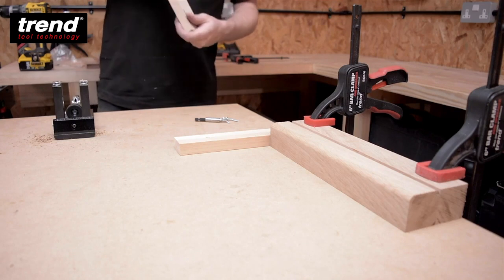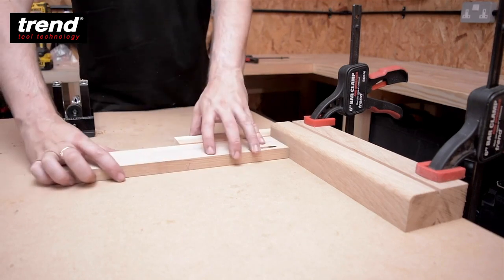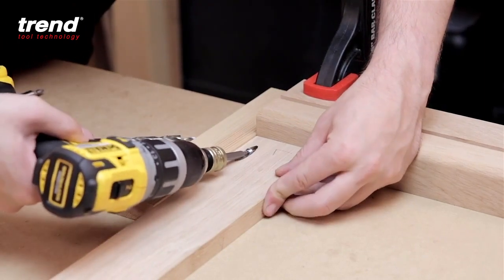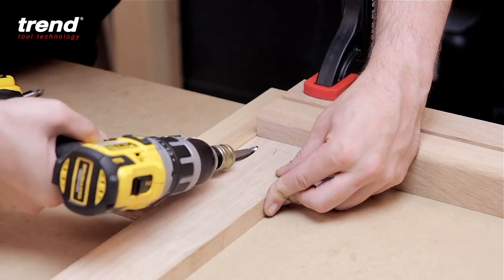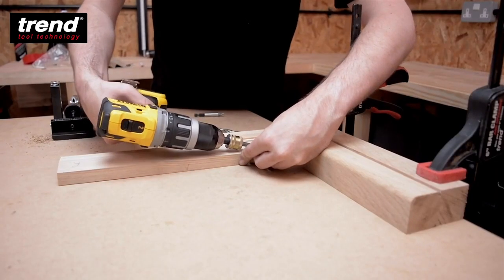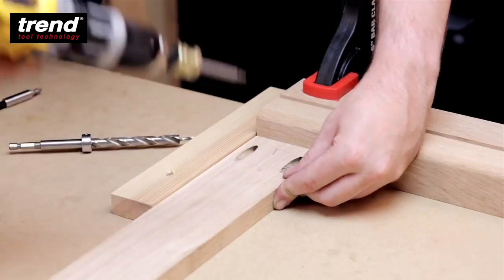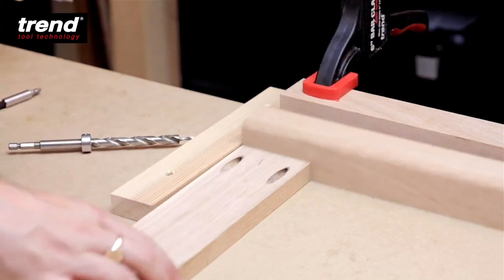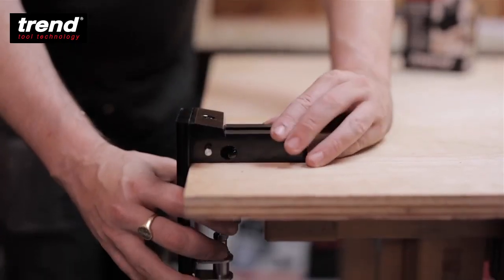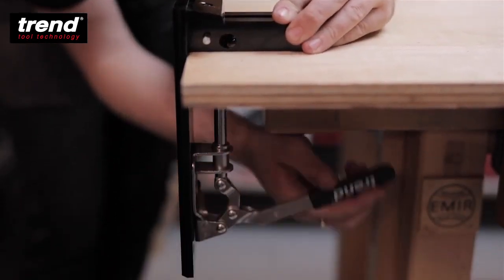When joining a 90-degree angle, position the material against a batten for support. The square drive self-tapping screws will join the material securely. A torque-controlled screw-driving drill is recommended. A pilot hole is not required. For larger jobs, the jig can be clamped to the actual component.